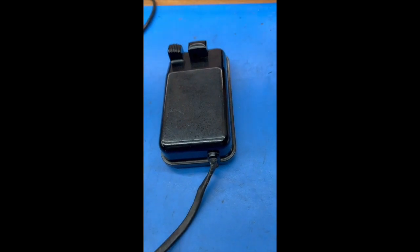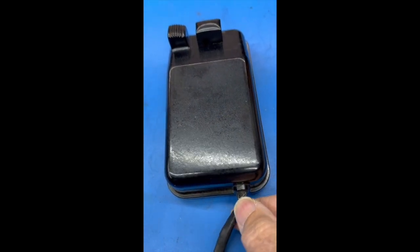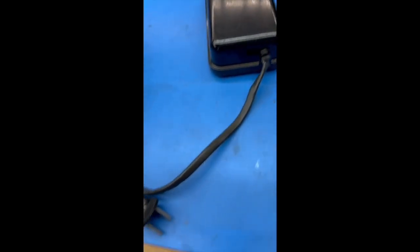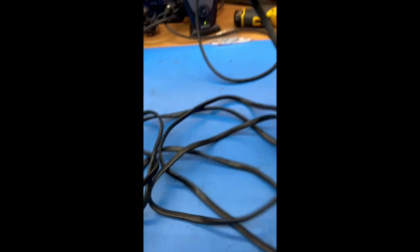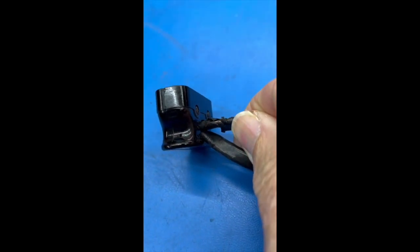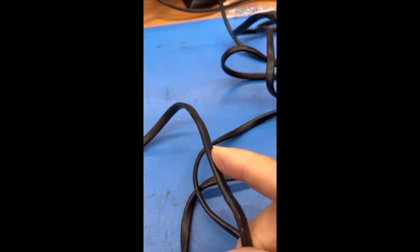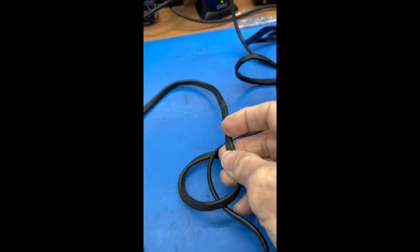As often happens with machines of this vintage, the electrical wiring insulation starts deteriorating, dry rotting, and cracking. You can see bare wire there, so the wiring going into this machine definitely needs to be replaced. The power plug looks pretty good, but unfortunately it's molded on, so we'll have to replace this entire assembly and put a new cord on. The older wiring gets brittle — if you bend it, you can actually feel it cracking, which could get somebody shocked or stop the machine working.